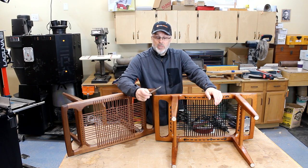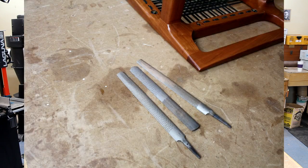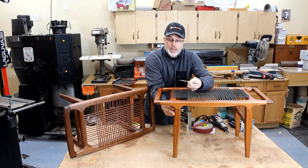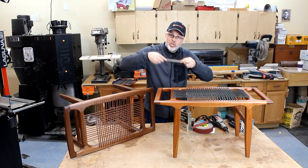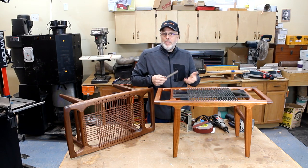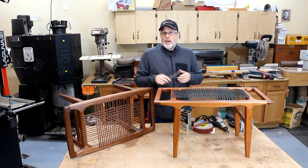I used a series of three different rasps — coarse, medium, and fine — sculpting each one of the joints. The key was to start several inches away from the actual joint and gradually blend everything together, making sure not to get into any ruts. The motion was two-fold: side to side as well as up and down in one motion, sweeping through and gradually shaping the joint rather than a sawing motion, which would quickly develop a track. That did start to happen a couple of times and I was able to finesse and feather that out. It took some elbow grease.